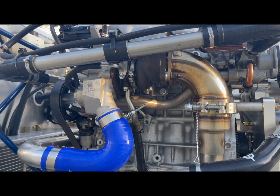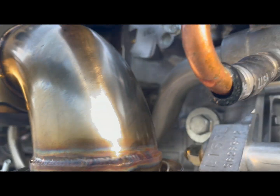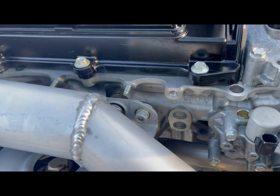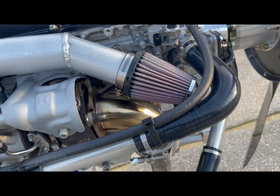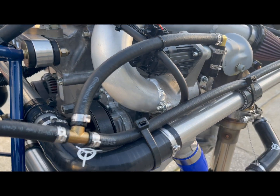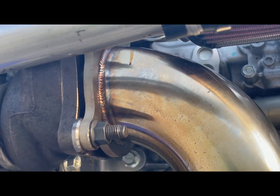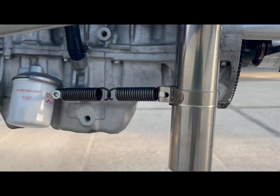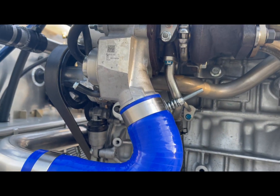Let's look at some of the details on the engine. Here's the turbocharger — it's bolted to the engine through a single exhaust port. It just bolts right to the side of the block because all the runners are internal to the cylinder head — there are no external runners. This is the cold air intake coming up front and running to the inlet side of the turbocharger. The hot side has the downpipe, which runs overboard through the cowling. We use a couple of springs here to stabilize the tailpipe so there's no vibration that could lead to cracking.